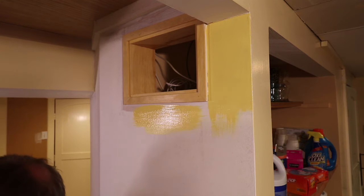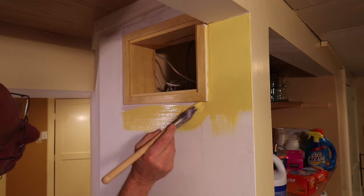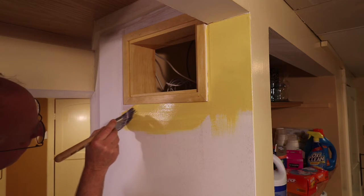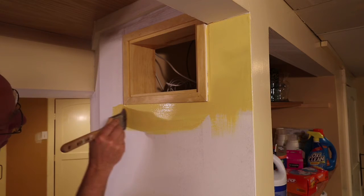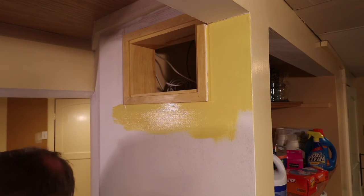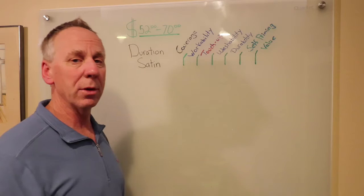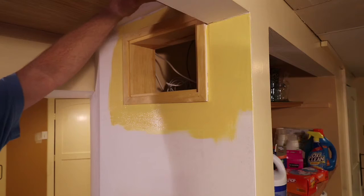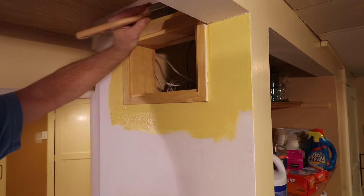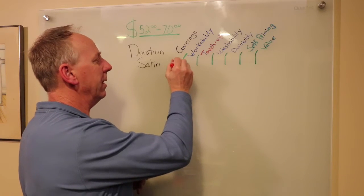The coverage and workability of this paint is very good. Well, the coverage is good. I'd say you get about 70 to 75% coverage on your first coat, but the second coat, it covers 100%. If you're looking to try to get away with one coat, it has to be a very, very similar color with a similar sheen. But my rule of thumb is, if it covers in 2 coats, it gets a 10 out of 10. So I'm giving it a 10.